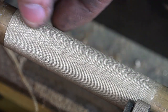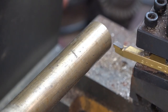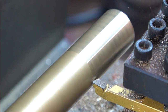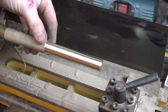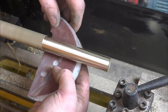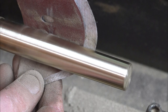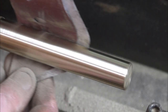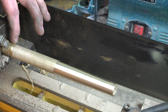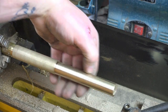So this is what we're left with - a rough face. You've probably seen that on anything that you don't want to slip out of your hand. Looks quite nice. I'll give it a clean up. Now we've squared that off, we'll turn it down to 20mm so it fits in the handle. So this is what we've got after turning it down. Just going to shine it up with a bit of sandpaper. That is looking nice. So now I just need to take this out, spin it round, just give this end a little shine up, and that should fit in quite nice. I've sloped it down a bit, tapered it down, just so I didn't have to take as much meat off. Then just obviously give it a polish up.